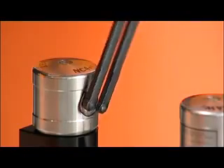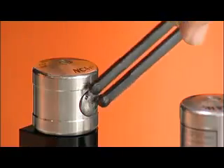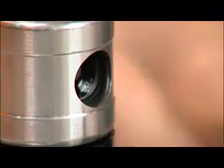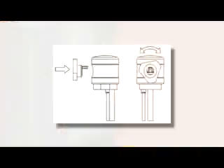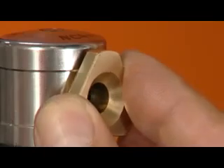To clean the laser optics, use the supplied pin spanner to unscrew the NC4 transmitter and receiver access panels. Insert the cleaning tool into the housing and rotate through 70 to 80 degrees until the passive seal is clear of the optic glass.